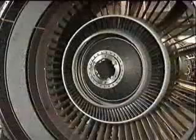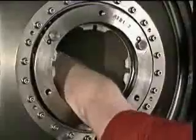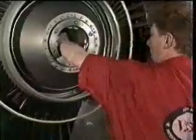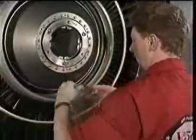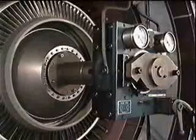The front lock nut is removed first, as follows. Release the internal retaining ring and remove it. Then take out the locking cap. Now the tooling to remove the front lock nut can be installed.